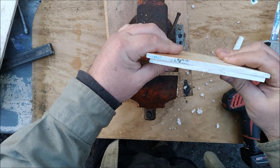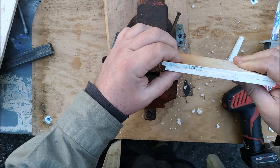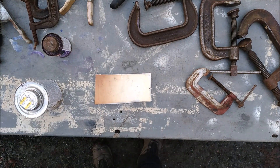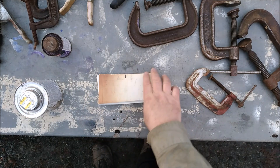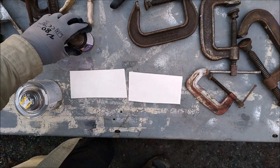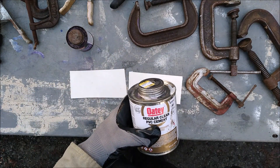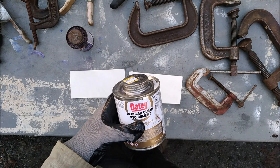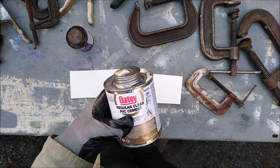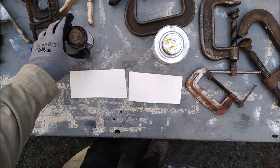Cutting it in half here. That's going to be what I glue together, and then instead of being a quarter inch, it'll be a half inch thick — that should be pretty good. You can see you're going to have to clamp things. I'm going to glue these two pieces. I've made some marks so I know the orientation I want. I'm using PVC primer and PVC cement. It's not really a glue — it melts the top layer of the PVC so it supposedly becomes like one piece afterwards, but it doesn't fill gaps good. So you want a nice clean contact area.